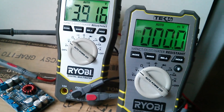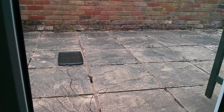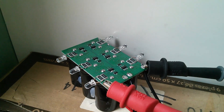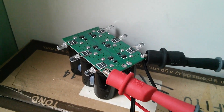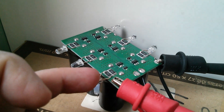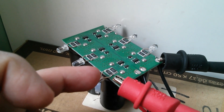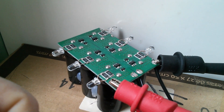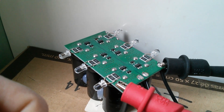Currently on the output of the buck boost converter we've got 0 volts. Now the first thing I wanted to know was: is it safe to leave that 2.4 watt panel permanently connected to this supercapacitor bank with only those protection components to prevent the capacitors going over voltage? Because that solar panel can get up to about 20 volts open circuit. I reckon it is, because these resistor pairs — these with 100 on them — they're 10 ohm resistors in parallel, so that's 5 ohms. You've got V squared over that, so 2.7 squared — possibly even 2.8 squared — is in excess of one watt. So that total board can dissipate at least six watts, and the panel is only two and a half watts. There's no way that panel is going to kill this supercapacitor bank — this bank with its protection circuits can prevent itself from going over voltage.